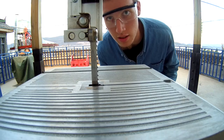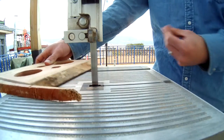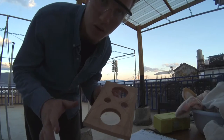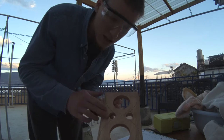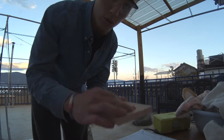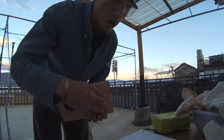Always be safe and wear safety glasses. Once you've cut it into a rectangle, just stop there for a minute, because there's another step we need to do while it's still rectangular. We want to drill straight into the piece so that it has a rotating effect — so these can lie flat on the table or be rotated upright. We're going to drill those holes now for the nail, and since it's still a rectangle, it should be easy to drill straight holes.